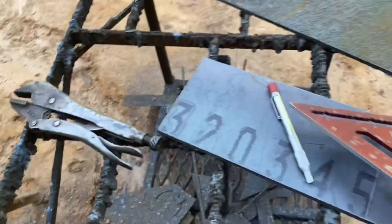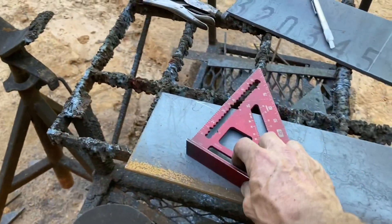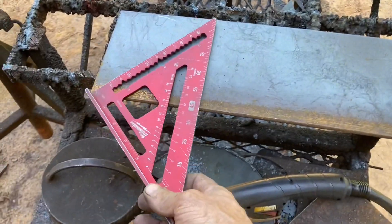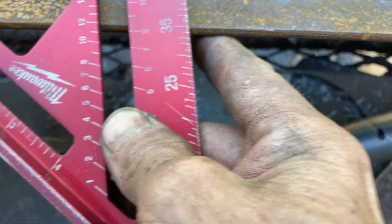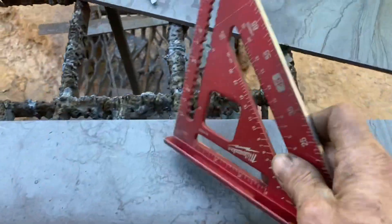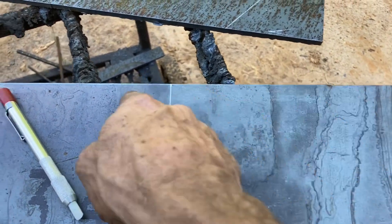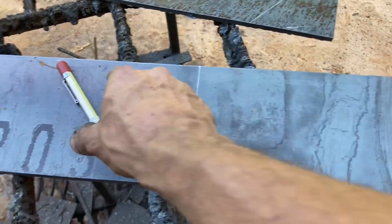Those are 35 degrees — I just kind of came to 35. I started at about 25 and started cutting more. The guy was asking because he didn't want to waste material. All you've got to do is cut your piece out that's five by 20 at 35 degrees on your square. Just line your corner up and mark 35 on the close edge. If you wanted the top to be a certain size — say these are 20 and I wanted the top to be 16 — get your mark in the middle and come back eight inches from each side. That's going to give you that top piece.